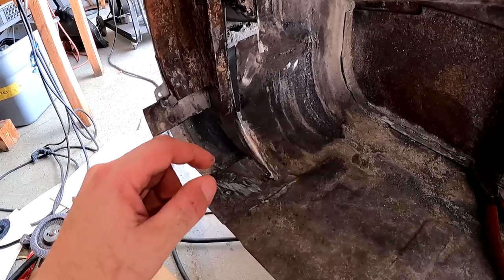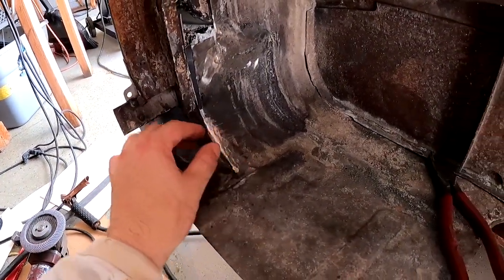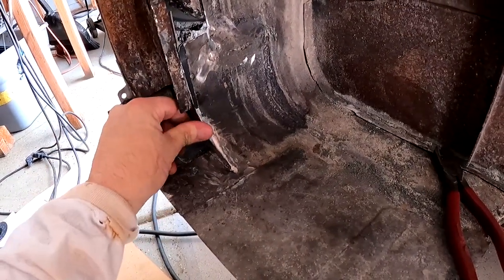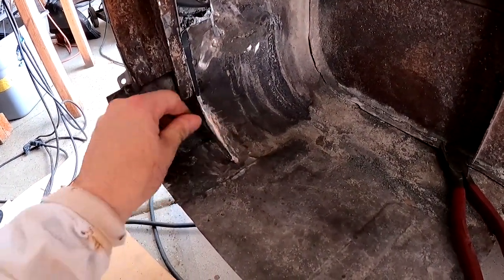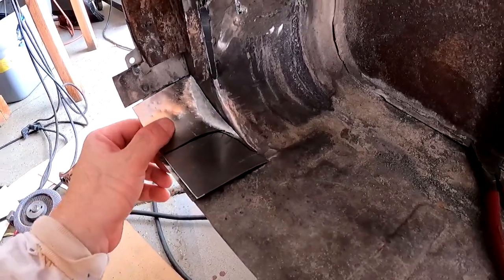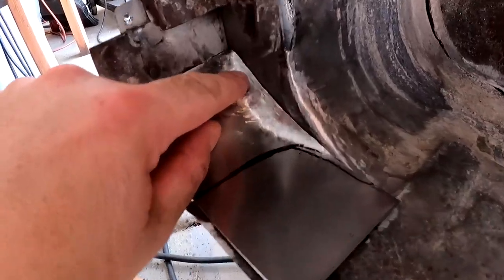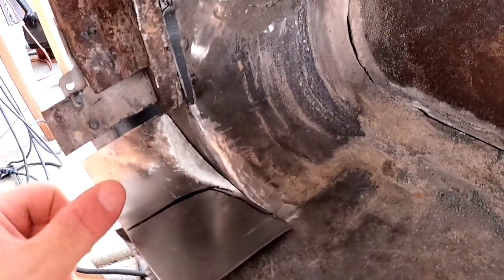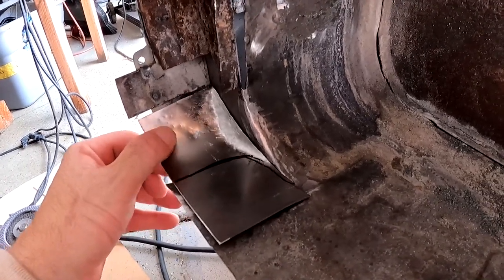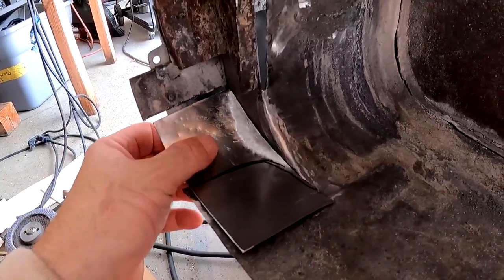The other one's going to have to have the same thing done. I'm just kind of making this up as I go here. I ground out this corner and filled it back in with weld and then kind of rounded it out. I'll smooth that out some more. Now I'm making kind of a piece that's going to connect here — it's a little bit rounded out — and I'll fill that with weld and smooth it all out. It should look like it's a piece that's been pressed into shape.